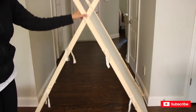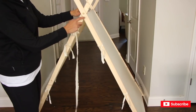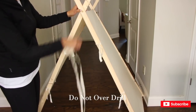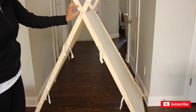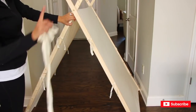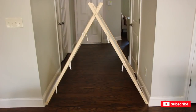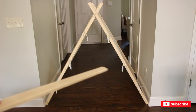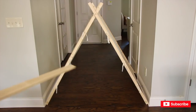Open, he doesn't want to stay. I either think I made the hole here too big, it's not snug enough to hold it there, or it's too heavy, but there's a solution for this. Okay, so if you run into this problem, you can do 2 things. You can grab an additional piece of wood, another strip, and hammer it to the back. Okay, that will give you support.